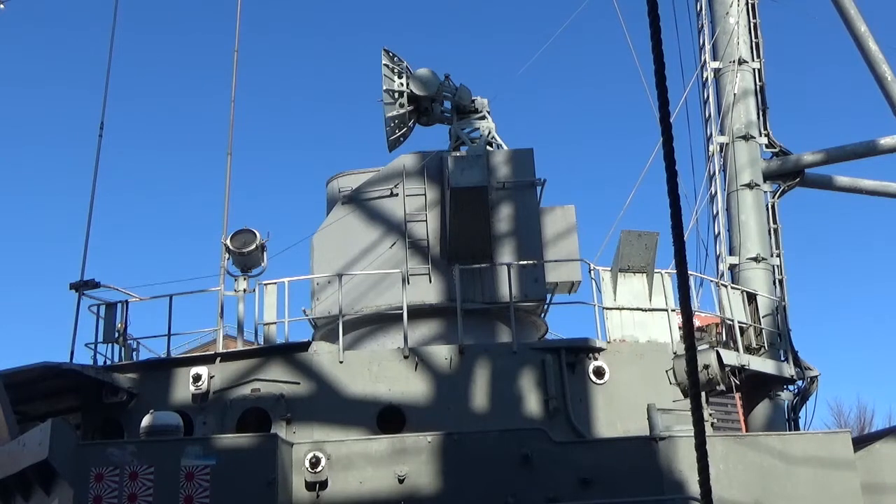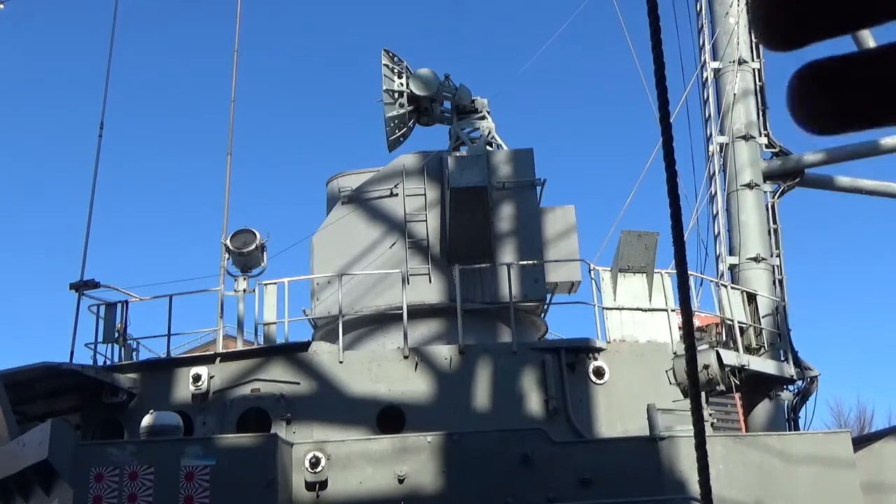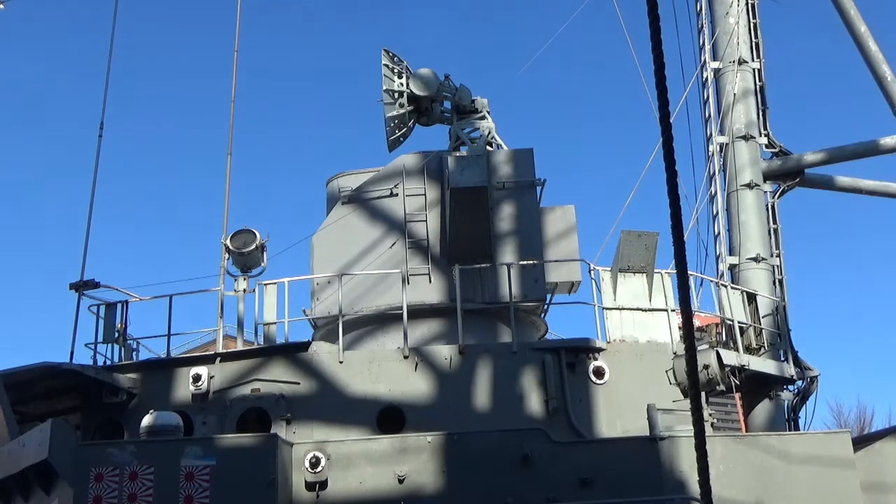The mount itself, with the trainer and the pointer in the mount, could also manually make adjustments. So all of this information is gathered, collected, tracked — the ranging and elevation of the targets — being sent down into the ship on the first platform to the gun plot. All of that information is calculated and then electronically sent to the five gun mounts along the center line of the ship. And that was for the five-inch. Now we're going to talk about the Bofors and the three-inch fifties.